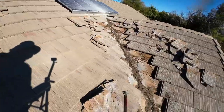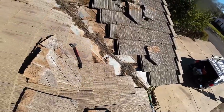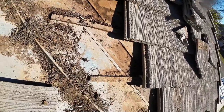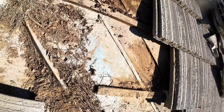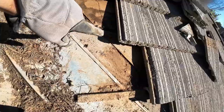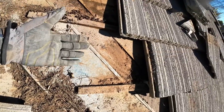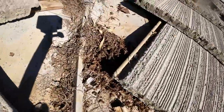All kinds of junk in the valley, as you guys can see. This one they actually built better than others I've seen — they put some underlayment underneath the valley and didn't overlap it on top. But they did two things wrong: the underlayment stopped short over there — it should have gone all the way under this metal flashing, so this flashing should have had two layers underneath it. But the contractor who built this house didn't care.